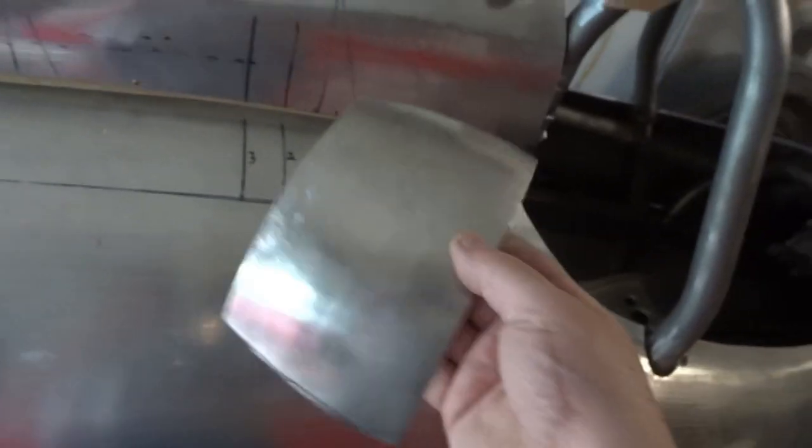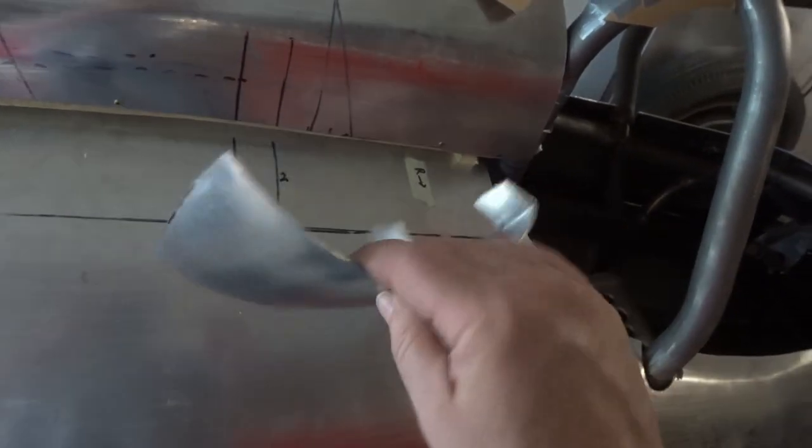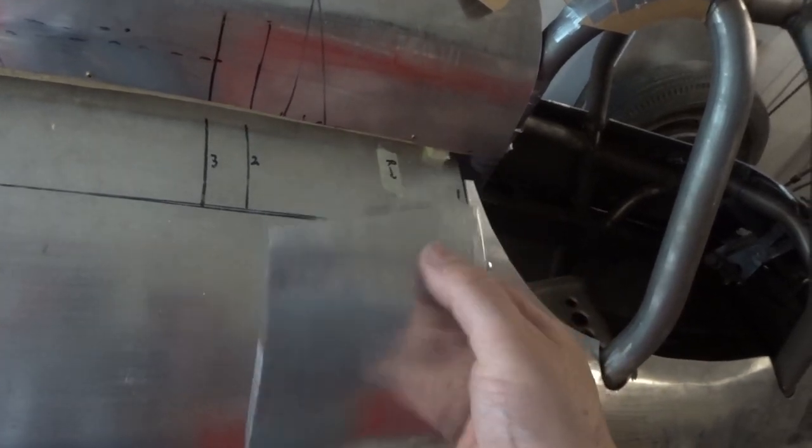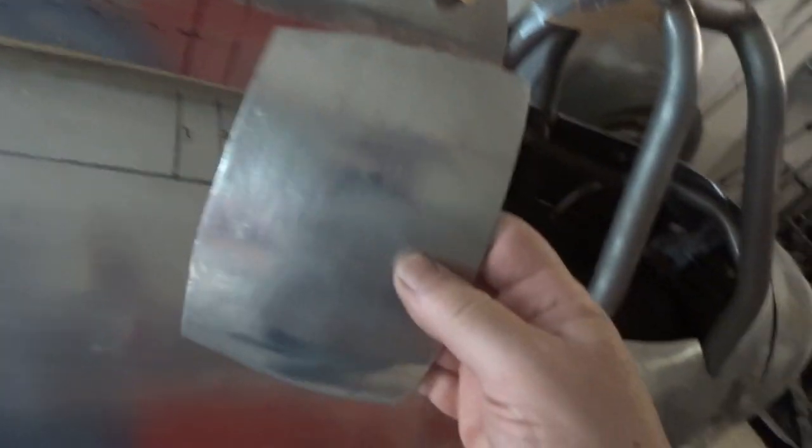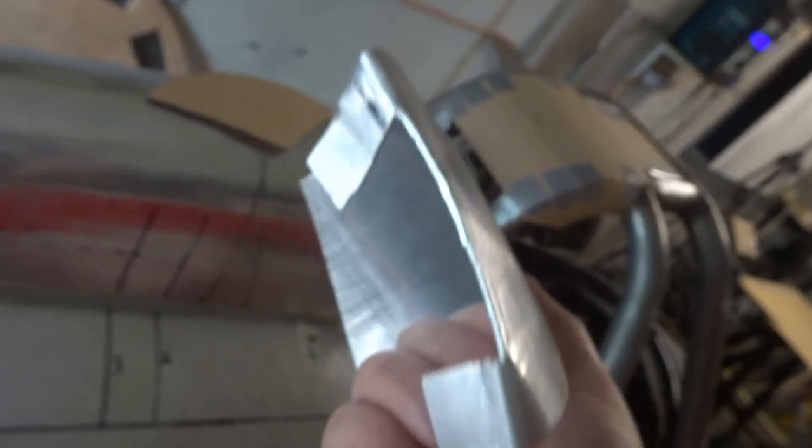The next thing is how to design those so they're not too hard to make, and I can make them match both sides without it being a total nightmare. So I copied those templates into wood like that, so I've got something to use as a buck — just put it in the vise. Then I've been using the English wheel on a simple panel, 10 centimeters wide. After a lot of fettling I've come up with this — it's just got a bit of a curve on it. It's easy to make it a little bit over length when you're wheeling it, so the end bit you'll cut off; I've left some tabs there and I'll trim them down.